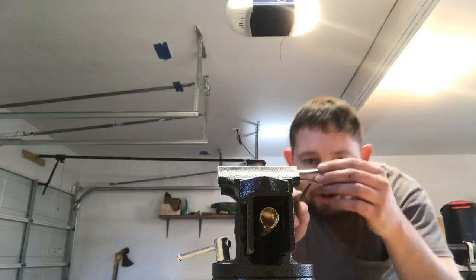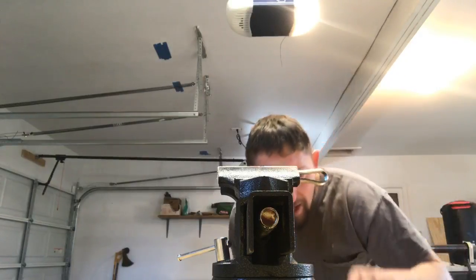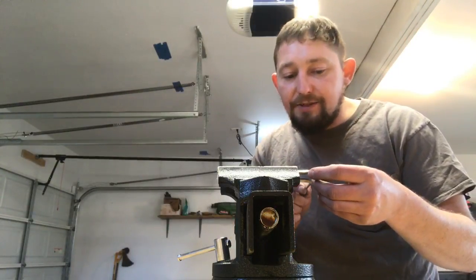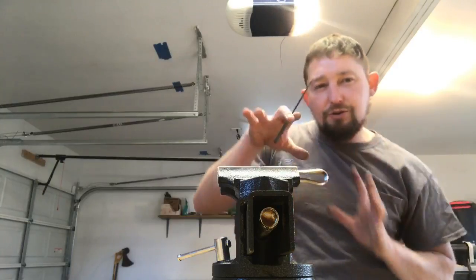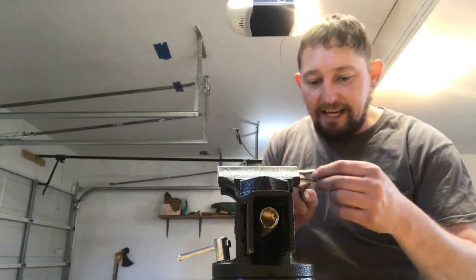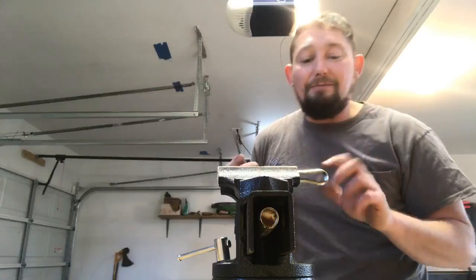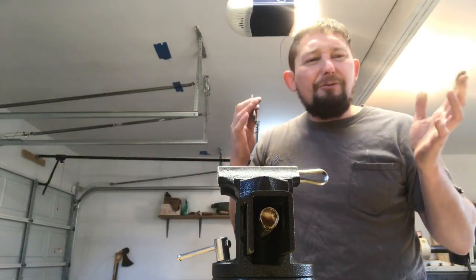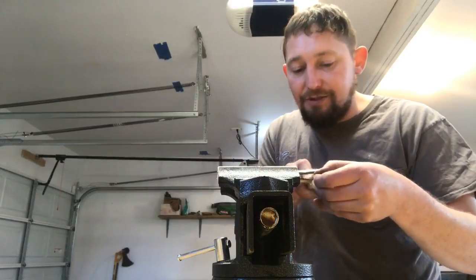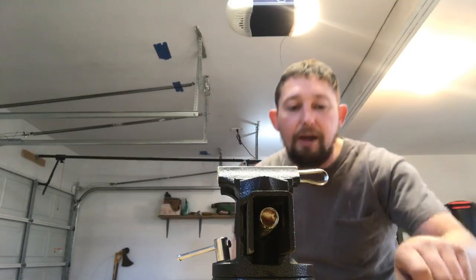You don't have to decorate your harps. I just like to add some type of interest. I never like leaving a harp plain. That's just my preference. And I'm not removing much metal. If you go filing, I have spent an hour or better filing all sorts of really decorative designs, multifaceted like diamonds. And what ended up happening, as many of the masters predicted before I even tempered it, the frame was too weak. Any jaw pressure, any pressure up against your face ended up closing the frame of the harp. So if you're gonna remove metal for decoration, take care where you do it.